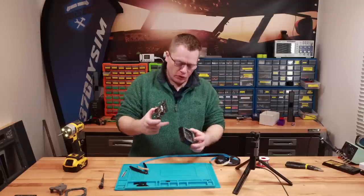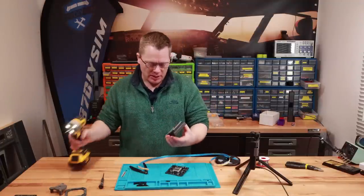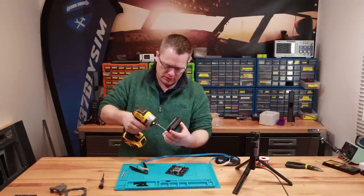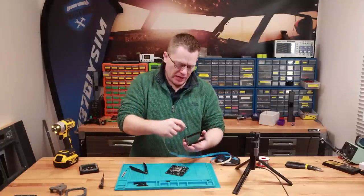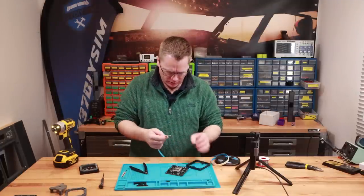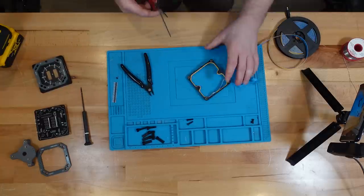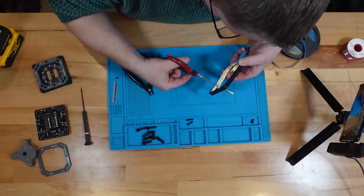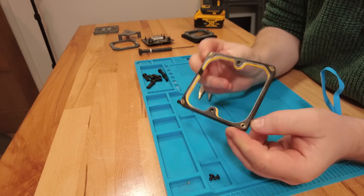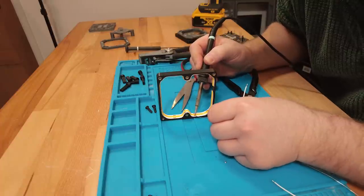We've done our LEDs for the face plate, but we need to light the decal plate — for that we've got to disassemble it. We take the spacer plate off and fit LED strip all around the inside edge. Get the scissors out, cut it on the line. Now we've got our LED strip placed all around the edges and we'll pre-tin two spots on the LED strip.